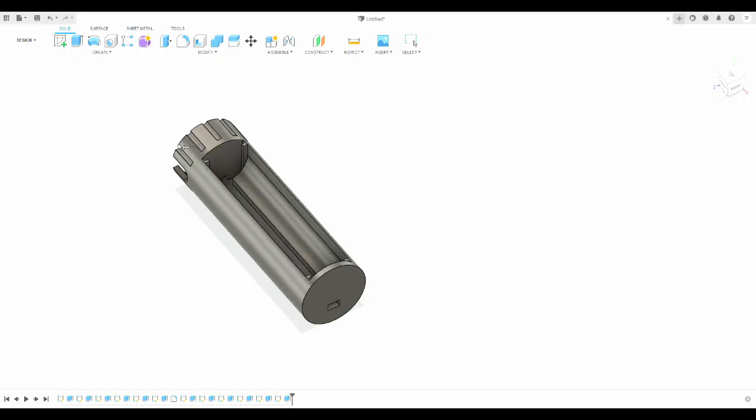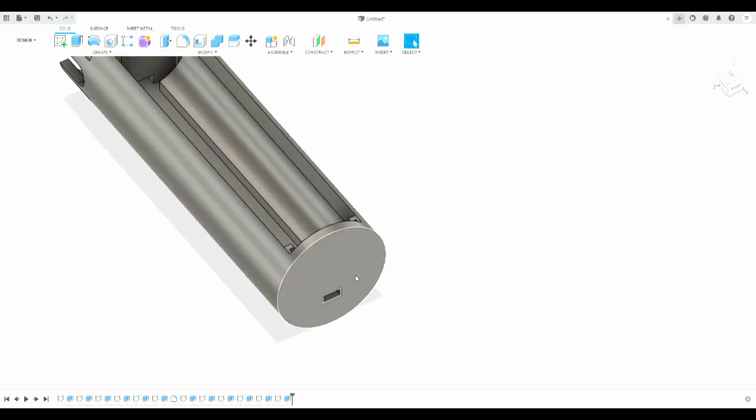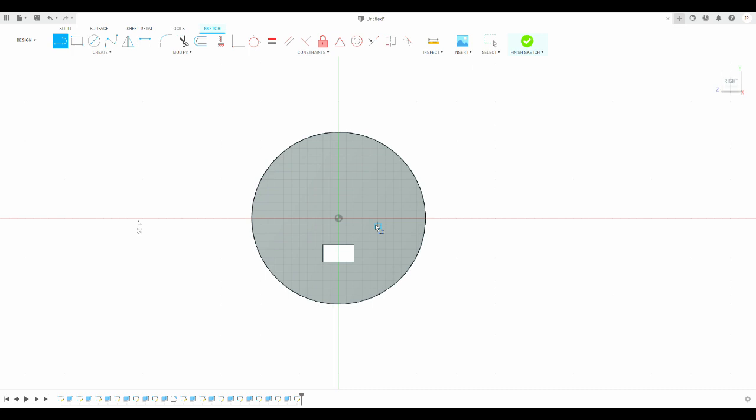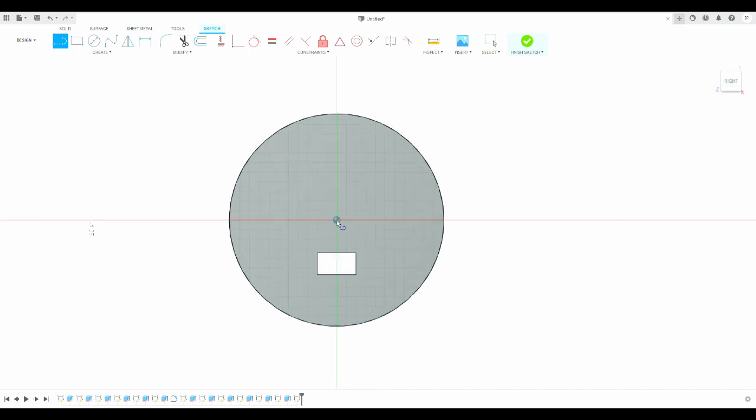Our wire path goes all the way from the speaker down here, and we've still got wire path right here to make it to the board. Now we want to draw our board, so we're going to go to this surface. I know that this is going to be for a Profi and I know that the Profi is 0.70 inches wide. So I'll start from the midpoint and do half that — 0.35 — and bring that line all the way up, then hit S and trim and get rid of that line.